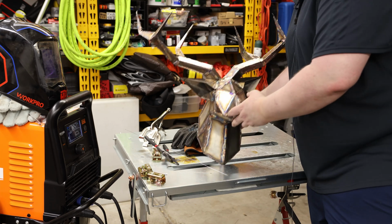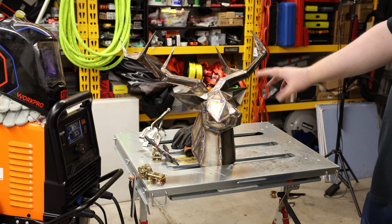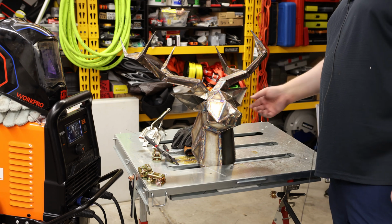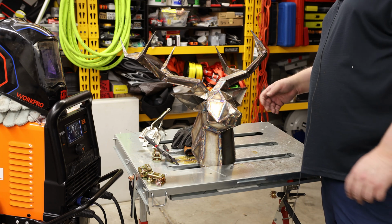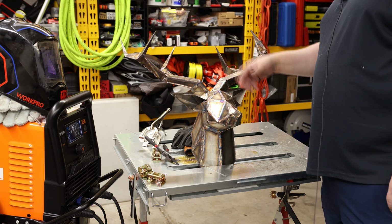That's kind of interesting, because when I started this project, I was expecting to put together something that'd be all nice, colorful, and very cool looking, and then just show it off to everybody. But it turned out this was much harder than I was expecting, mostly because of the thinness of the metal. I was burning holes all over the place, and when things started burning through, getting those filled in was even more difficult, because I had to put more heat on it to get the filler rod in, but by the time it touched the metal, it had already melted away.